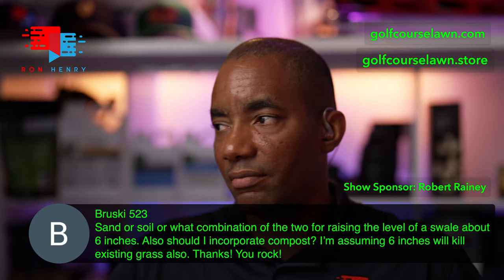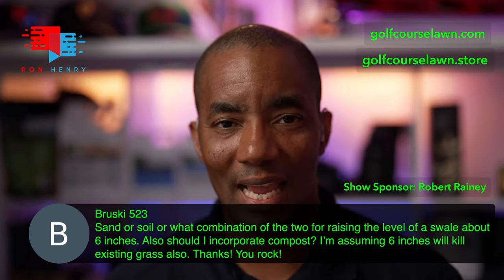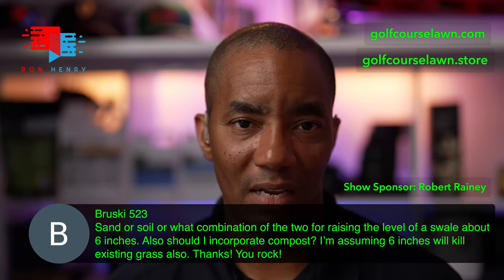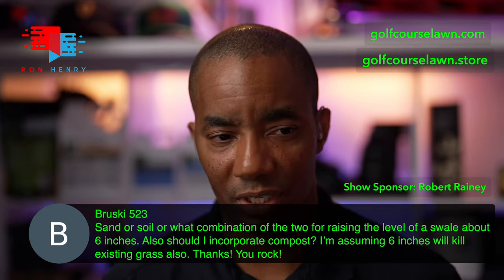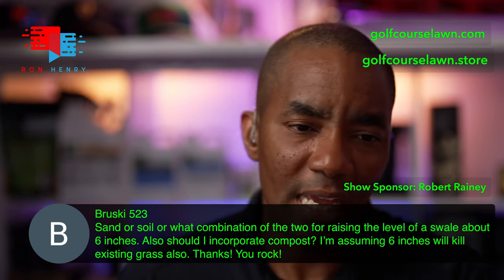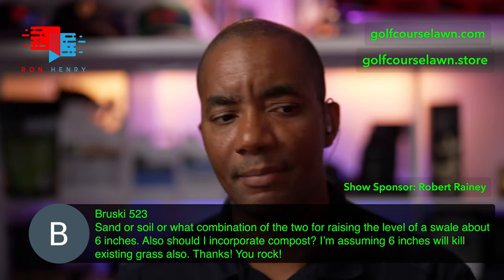But if you're talking about an area that's, you know, 10 feet wide, I wouldn't want to put down 6 inches of sand in that kind of an area. I want to use more of a fill dirt type product in that particular scenario. So if you can send me pictures, I'll take a look at it and that would give you a better answer. But that's what I'm leaning towards.